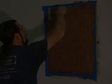Those niches, I probably have, well, they were already textured, and I had to smooth them out with drywall compound, because there was a knockdown finish. If it was a hand trowel finish, I probably could have gotten away with it, but most of the finishes that I do are designed to go over smooth wall.